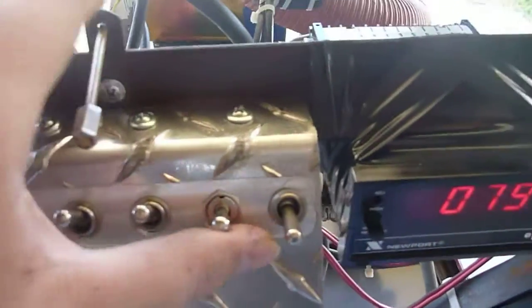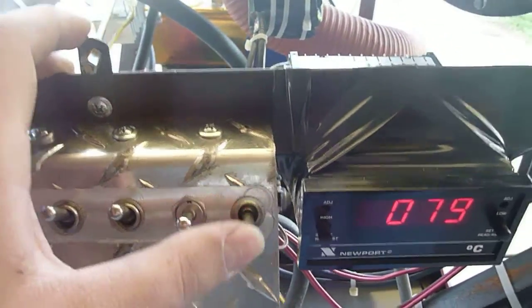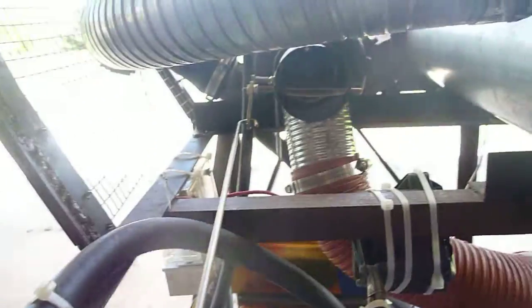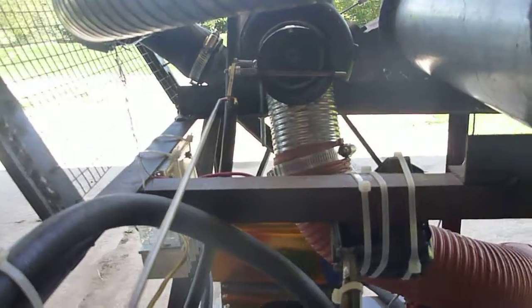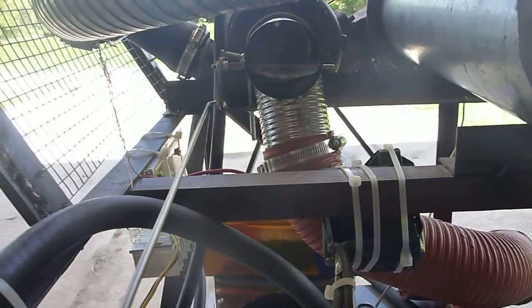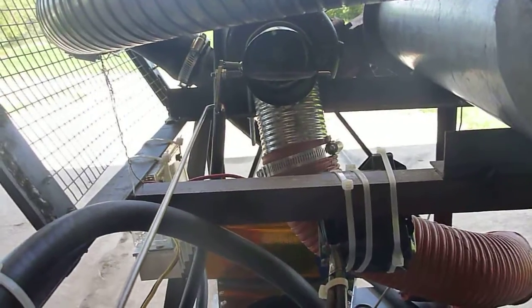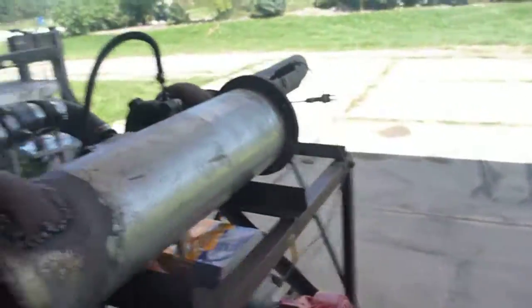We have the igniters, and there's a cool little butterfly valve system in there that goes to the turbine. When we turn on the leaf blower, it automatically closes itself. Then when the turbine starts up and takes over, it creates more suction and sucks in more air than the leaf blower can supply, and it opens itself back up again.